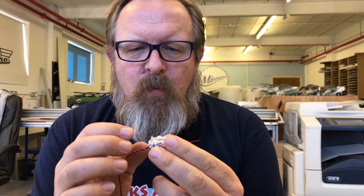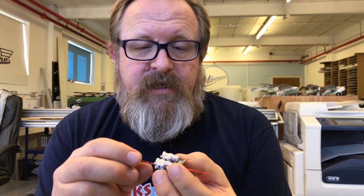So the issue started when we noticed, certainly a lot of customers noticed, that they were getting either one or both servos failing fairly rapidly and fairly dramatically as well in some instances. It normally manifested itself in one or both of the motors heating up very quickly during use, and it would cause the servo movement itself to stutter and stop. In the worst offenders, this would happen literally almost within seconds of plugging in the battery. You didn't even have to have any movement. But on others, it would take a little while.